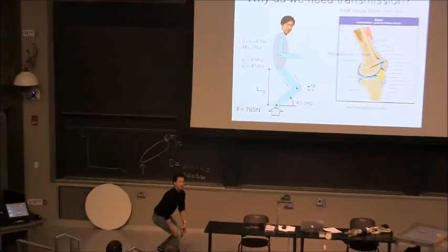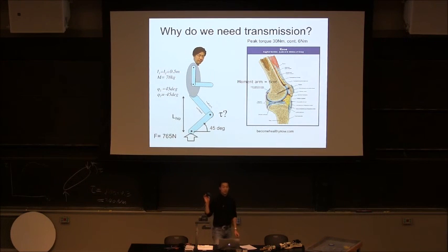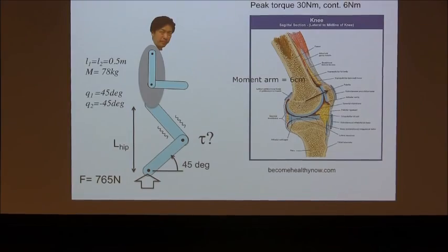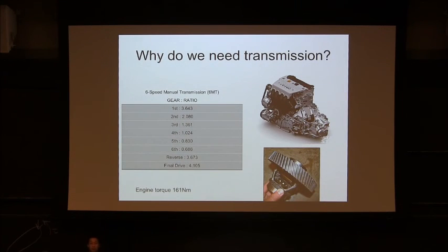When I'm doing this squat, my knee joint takes about 240 Newton-meters. These motors produce about 2 Newton-meters at worst case. The moment arm from the center of rotation to the kneecap is about 6 centimeters, so the quadriceps muscle produces about 3,000 Newtons. Honda Civic engine torque is about 160 Newton-meters — my quadriceps just produces about twice the torque of a Honda Civic engine. When jumping, probably about another 50% more.